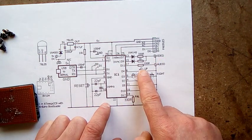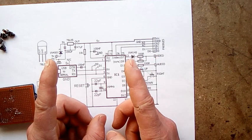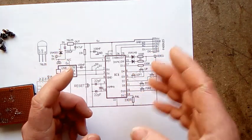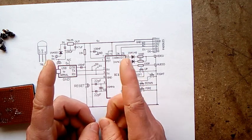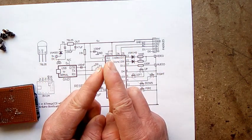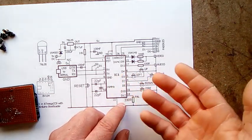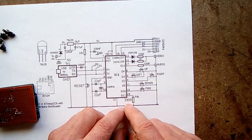For the push buttons, it's simple enough. You've got two points: one goes to ground and one goes to a digital input on the Arduino. When that digital input is pulled to ground it registers the button press, and then the code tells the Arduino what to do. So you have a ground point and your buttons connected to a particular port. If you press the up button, for example, that joins D4 to ground, and once the Arduino sees that it performs whatever the code says to do when that particular button is pressed. The same applies for all the other buttons too.